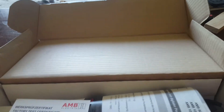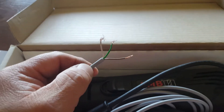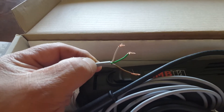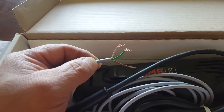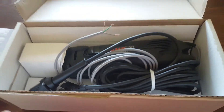It says dash P so I'm hoping this is the digital interface — yeah, I see it now. This is a three-wire system: one is 12 to 26 volt and that controls the power, the white one is ground, and the green one is your zero to 10 volts control voltage. At one volt this router spindle will turn on to 5,000 RPMs, which is the minimum, and at nine volts it'll go to 100% power which is 25,000 RPMs.